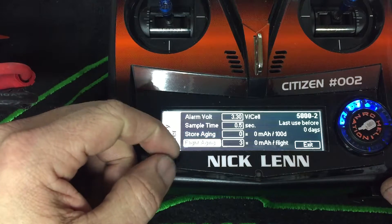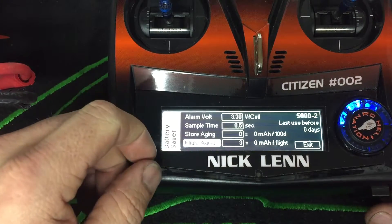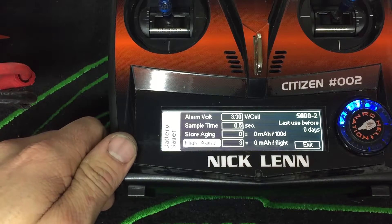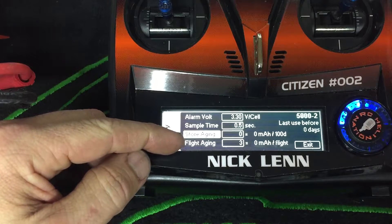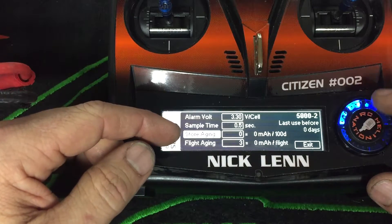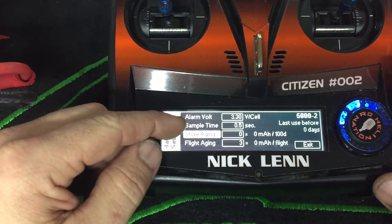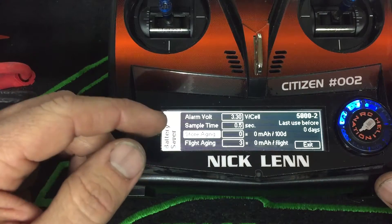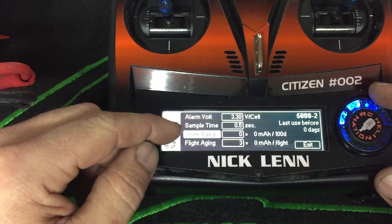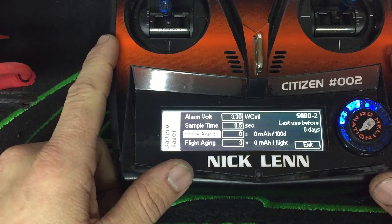Before I had ballparked about three milliamps worth of loss per flight, but there's a lot more to it than just the milliamp-per-flight number — that's going to depend on your pack size. What I really want you to know is the actual calculations behind these two settings. For Store Aging, that's the one that's going to be fairly accurate. There have been a lot of studies — you can Google it and find storage capacity per storage time. A lot of this depends on your storage conditions. We really need to be storing our batteries at storage voltage, about 3.85 or 3.8 volts per cell.